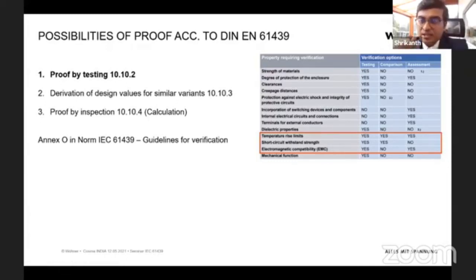the IEC standard has a set of calculations, and you just have to calculate with the information from your panel. And once you put in this information and calculate yourself, you have a value and you follow this value. And once somebody is assessing it, they just check if the calculation is right, and this is allowed. But that again comes down to calculating each and every connection and each and every part you are using, and also being sure that the material is what your supplier claims it to be. So there are some complications when you are taking the assessments. Mostly the testing and comparison is normally used in the standard.